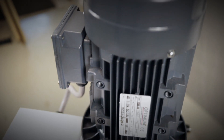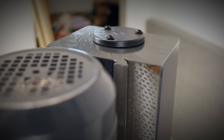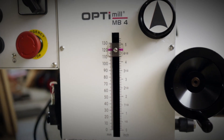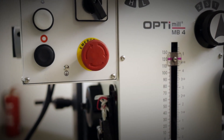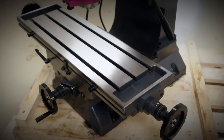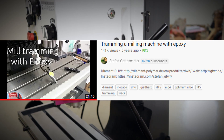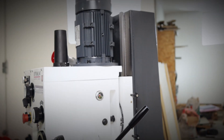Another minor problem I found is a small surface rust spot on the top corner of the column, but since it's the most top region and non-wearing I already buffed it out. The overall geometry is good except the alignment of the column — it's leaning sideways quite a bit. I will shim it in the first place, but in the end it will probably be epoxied like the mill from Stefan Gotteswinter. As usual, thanks for watching and feel free to leave a comment.